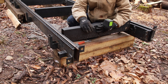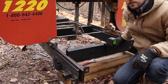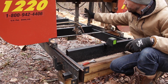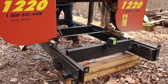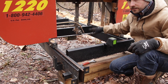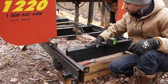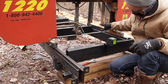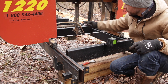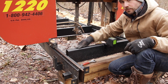You'll try to pick it up maybe two inches off the bed height. You first need to make sure that you tighten the blade at the designated tightness of your sawmill, and then pull the head as wide open as it can go — that way you're measuring the full cutting width of the sawmill. Before you do that, make sure that this bar right here is parallel to your sawmill bed, because the height of your blade will change when you extend it all the way out.